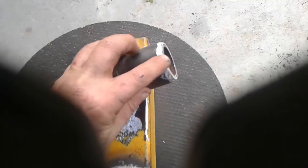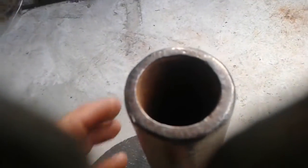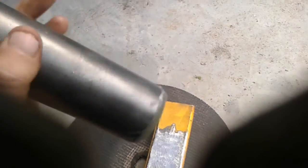So I've got about a 30-degree bevel on this thing and now I'm going to weld it up. I need to figure a way to keep it from moving — this stuff is so heavy and hard, it's like tool steel, unbelievable. I don't know if it's going to pull when I weld it. We'll see. I've got to keep it on a 90 degree and figure a way to keep it from moving, twisting, or cocking to one side when it's getting heated up. I'll bring it back when I start to weld. Cheers.